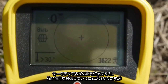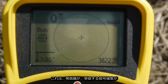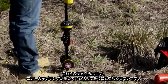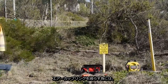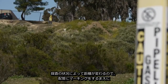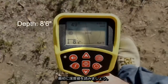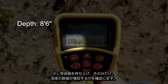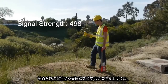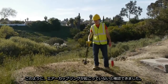Looking at our SeekTech receiver, we can see that we're getting a strong signal, but the elements inside the mapping display are missing. That's because SeekTech receivers hide these elements unless the signal is stronger at the lower antenna than the upper antenna. In this case, the signal is equally strong at both antennas, and the receiver is letting us know that we are severely air coupled by hiding these elements. To minimize air coupling, we'll need to begin our locate some distance away from the transmitter. We're positioned over the target utility, and the first thing we'll look at is our depth reading. If we raise the receiver by about a foot, our depth reading should increase by the same amount, which it does. If we raise the receiver off the target line, the signal should drop significantly, even if we aim it directly toward the transmitter. In this case, we're confident that we're not air coupled, and we can begin our locate.